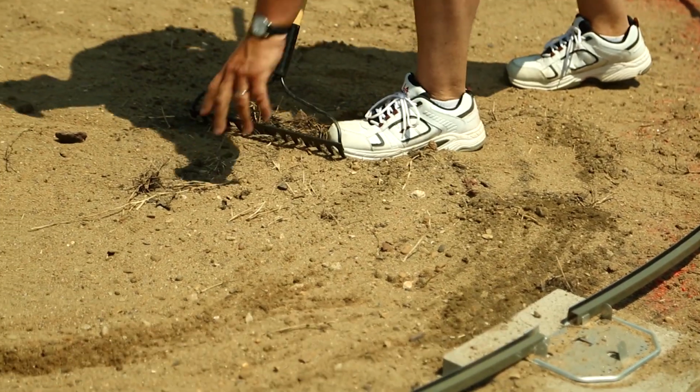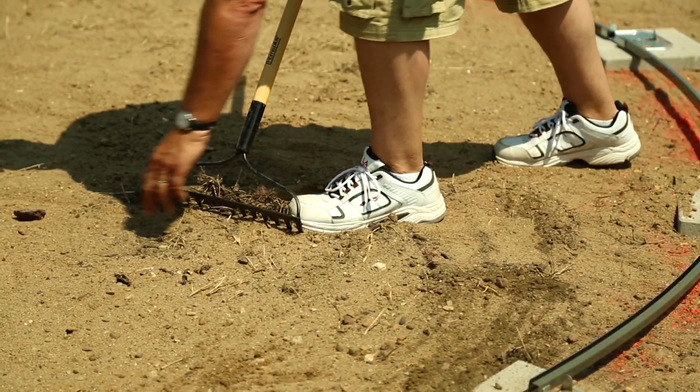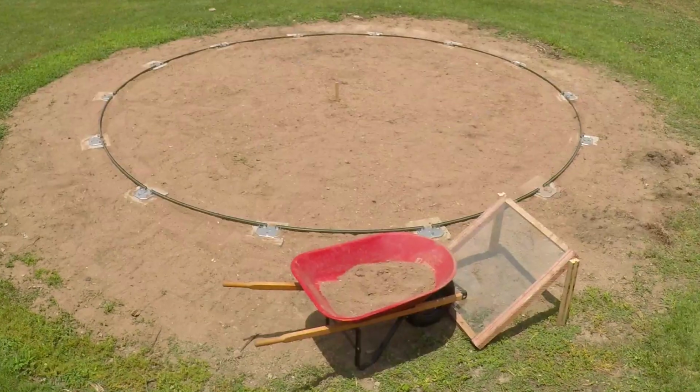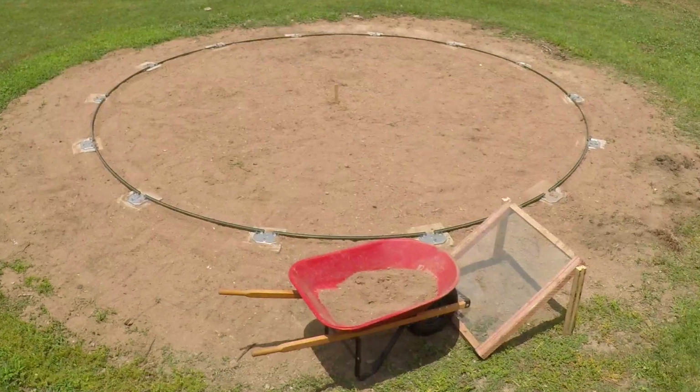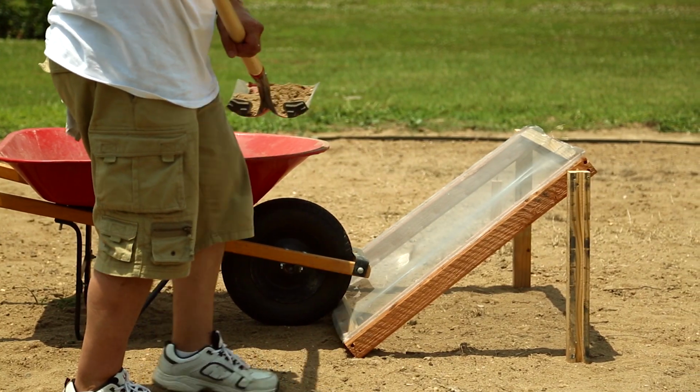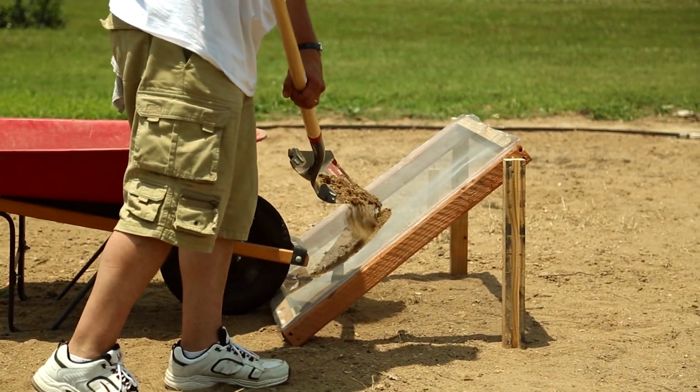Before we go into the installation of the pool wall, remember to clear the pool floor area of any debris that could puncture the liner. If you're going to use an earth cove, now's the time to bring the sifted earth into the pool area. Use a sifting screen to remove 1/8 inch pebbles or larger as shown here.